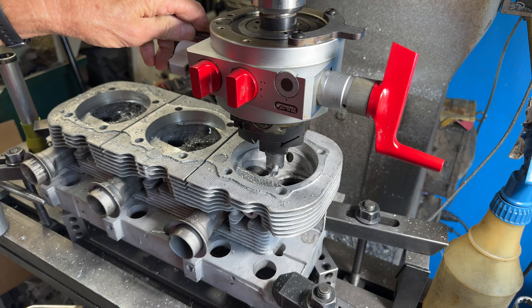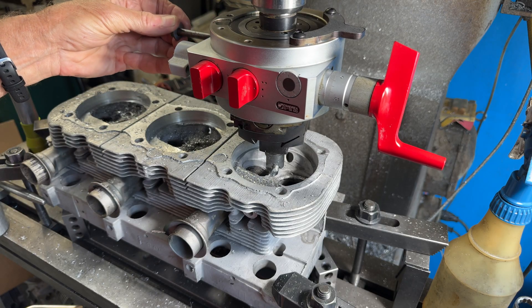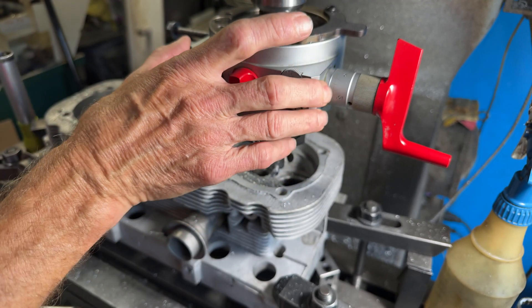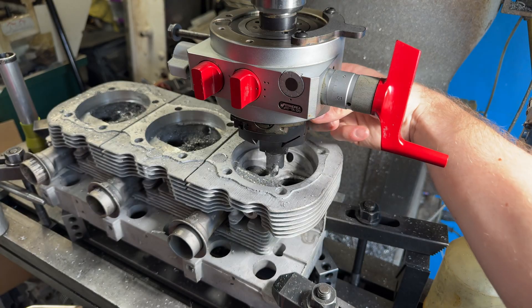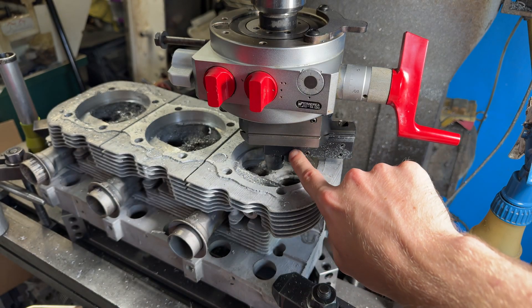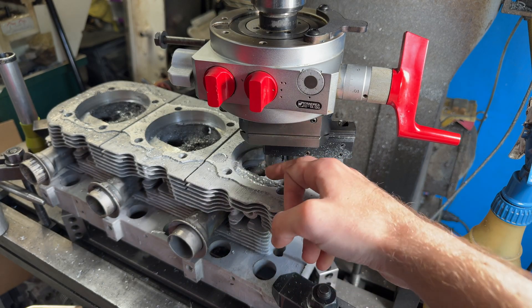We are still holding it by hand — there's going to be a pin that comes down and centers on this to lock the head from rotating, because the body needs to be stationary for the mechanism to operate the boring and facing part of the head. This piece moves back and forth, this holds the tool, and we had to offset this a ton in order to get the right diameter and right cut.